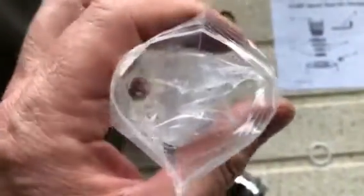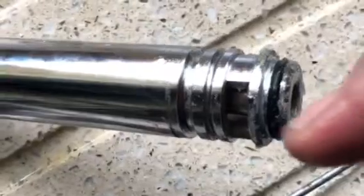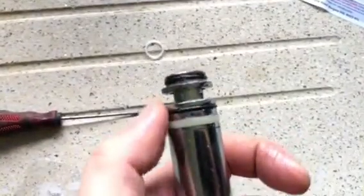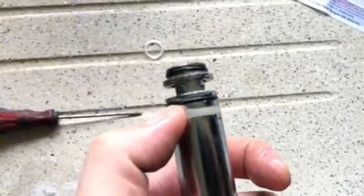It is recommended that you smear the o-rings in this special grease. I've got the lower o-ring on, and then I'm going to move to that o-ring there - we just basically keep working up, going over to each o-ring. I believe that is the correct way to do this, so I've just gently eased that one in place, trying not to overbend it.